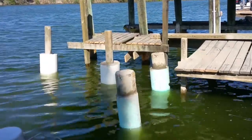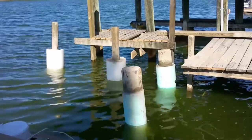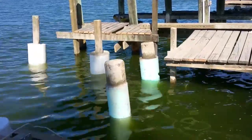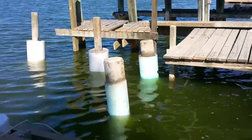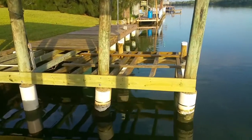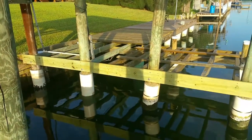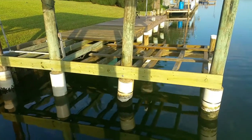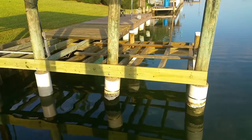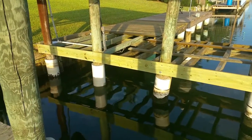I've got two on the outside there. The two white ones are the repair jobs — they're finished. The other two are pilings in good shape, but I went ahead and sleeved them in PVC and filled the annulus with cement. That's some more of the piling work on the boathouse. I had to split the PVC longitudinally, wrap it around, drive it down in the mud, and then fill it up with cement.